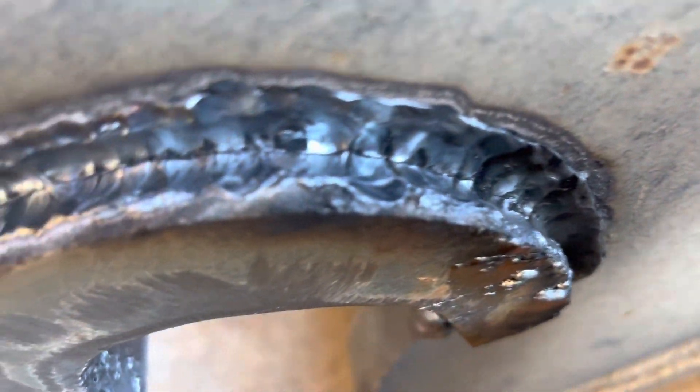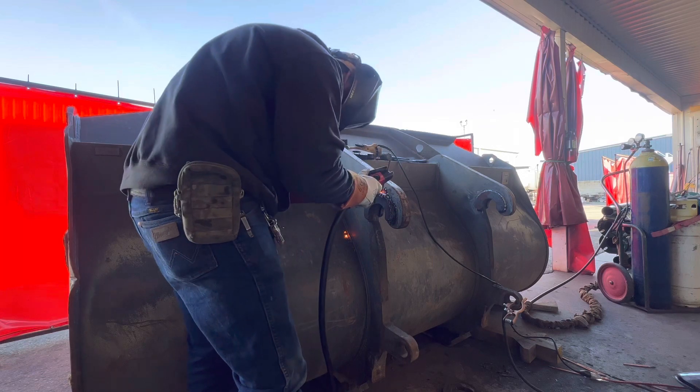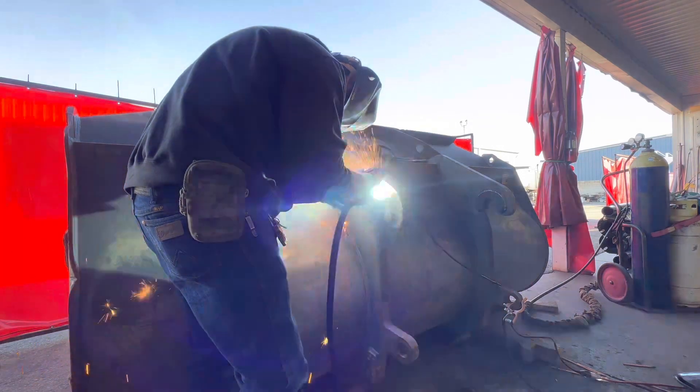You can see right here with the air gouge — it's nice. You find that little crack in the weld and you just follow it all the way around. Pretty clean. You take your grinder, not a huge mess to clean up. It's pretty nice.